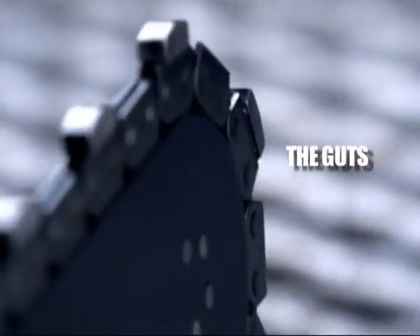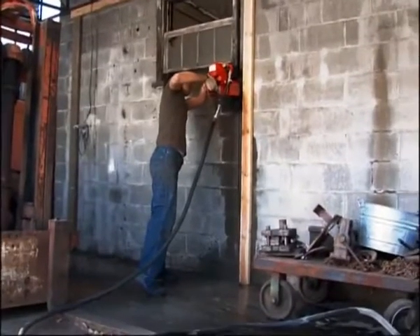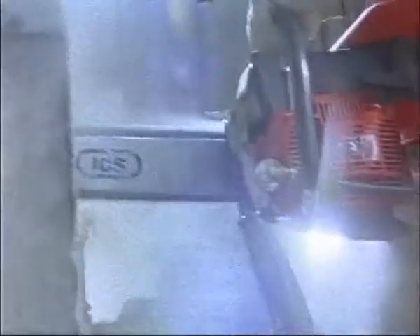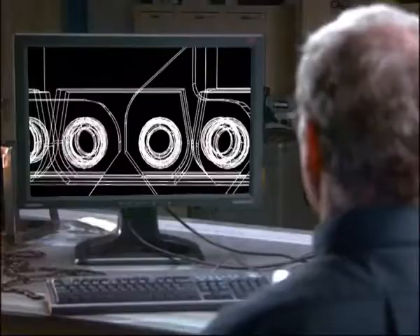There's a big difference between a wood cutting chainsaw and a concrete cutting chainsaw. Diamond chain technology is a very safe way to cut concrete. It really uses more of a grinding operation — more like using sandpaper to wear something away at a very rapid rate. But there's really no kickback associated with it.